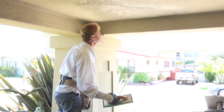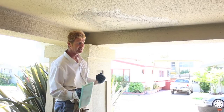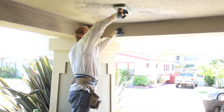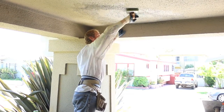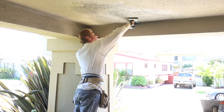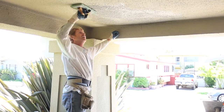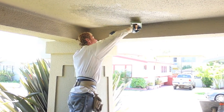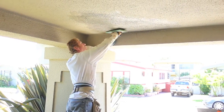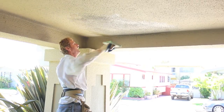There's the float. I've got a lot of water on here. I want circular motions — I want to push it up. I don't want it to fall on my head. I'm pushing it up. I'm actually using about 15 pounds of pressure — that's a lot, like lifting 15 pounders over my head. I'm pushing it because this is hitting those studs, hitting my plaster welds. I want it in here. I just put this on. There you have the float. The last thing I'm going to do is dash it — that means I'm going to go upside down and throw mud on it.